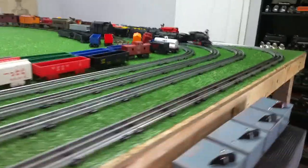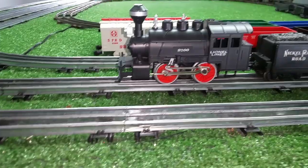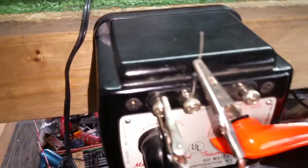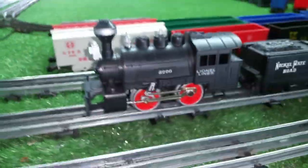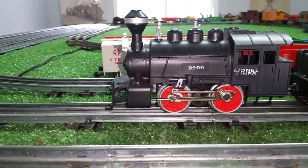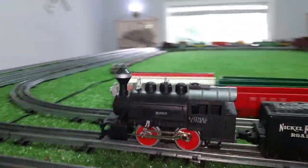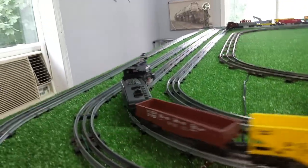It was a really cheap way to get one of these locomotives and I did some research and knew it was DC. Just add a simple diode to the transformer — and if you switch the wires, you also switch the direction. You could add a switch to the motor for forward and reverse, though I don't think I'm going to go to that much trouble. This is a neat little locomotive. It was really inexpensive, virtually new — no one wanted it because it wouldn't run on AC power — but just by adding a single diode, this little locomotive runs really well.